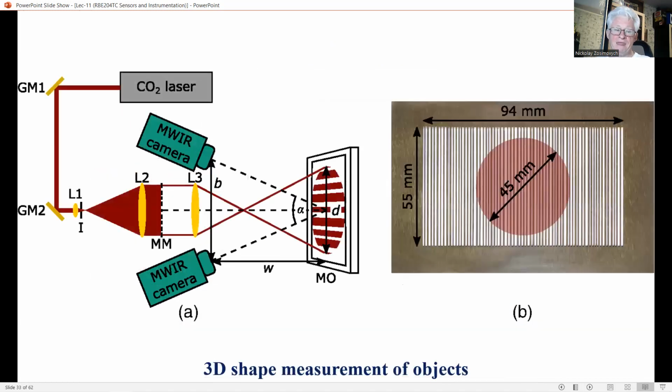One of these methods is based on triangulation to obtain 3D shape information about classes of components, like ICs, capacitors, batteries, and so on. Also here, the object, the PCB component, is illuminated from two sides to eliminate shadow effect. Instead of one line, a sequence of line patterns is projected on the PCB, which is viewed by a single camera. From the obtained range data, the shape of the relevant parts in the image is reconstructed and parameterized to match them with the corresponding parameters of standard electronic components.